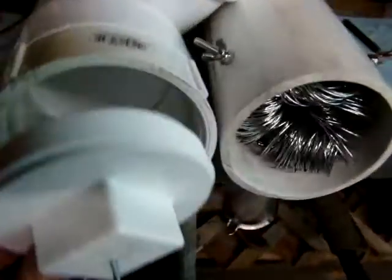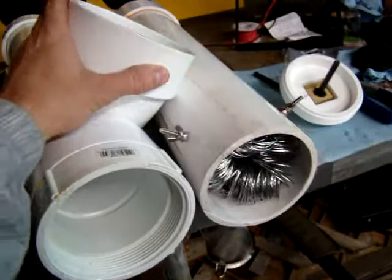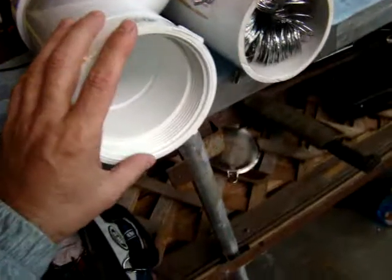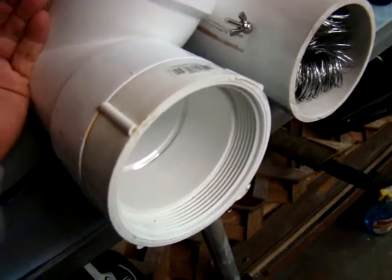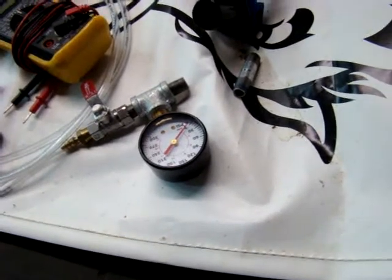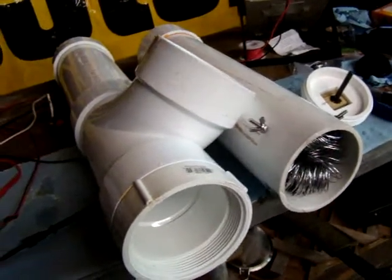This is set up and cured long enough, so the idea is to finalize this connection with PVC cement. I'm going to give it about 30 minutes or so, then close this end up with the ball valve. I'll fill it with water from this end, leaving it sitting at an angle so that there is some room for a head of air. Then I'll put the cap on and flip the thing the other way around — this will be the top poking straight up in the air. I should be able to measure the pressure going up over a period of time and calculate, based on how much volume I have, how much gas I was able to produce. I'll get it together and then I'll have another video with it running.